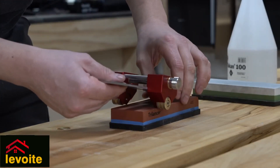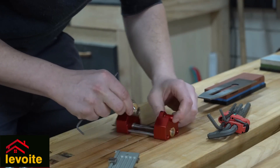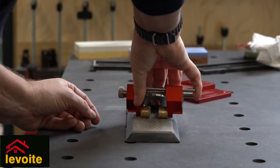When you want to sharpen a very wide chisel or planar blade, the wheels will go outside of the sharpening stone. In that case, we have to place the wheels on the inside. The two wheels together still make it very stable, but when the blade is wider, the stability is less critical.